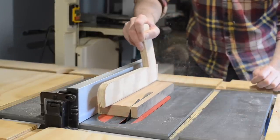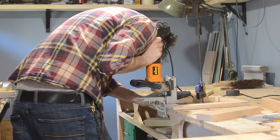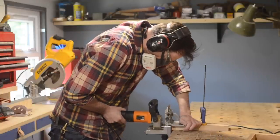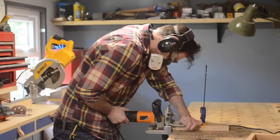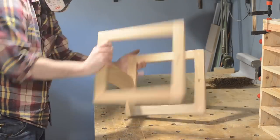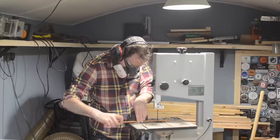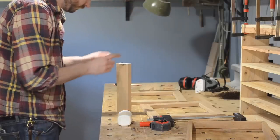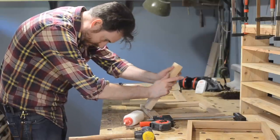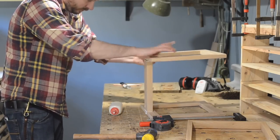The bottom of the legs are going to be braced with some copper rod, but I want something to brace the tops, so I'm going to cut down some oak — this is also going to give me something to attach the table top to. I use my doweling machine to put some holes in the top of the legs and then in the ends of this brace. When I ripped that bracing bit down I kept the offcut, which is exactly the same length, and that's going to come in handy in a second.